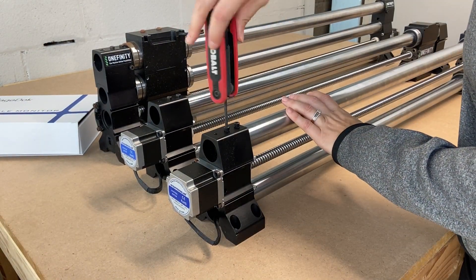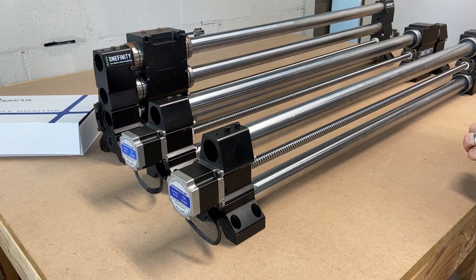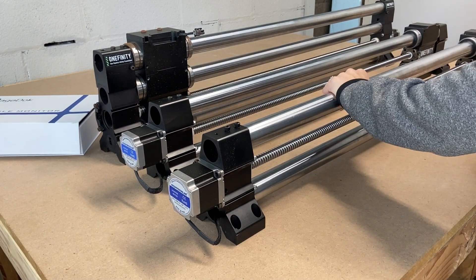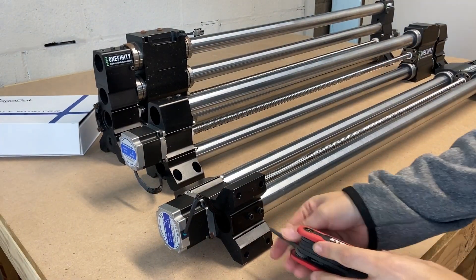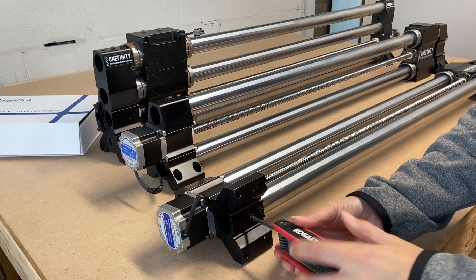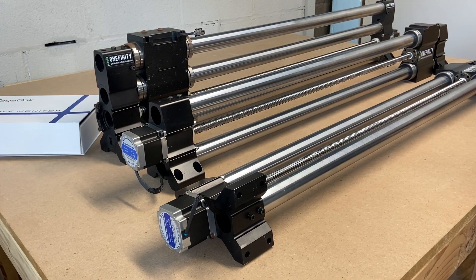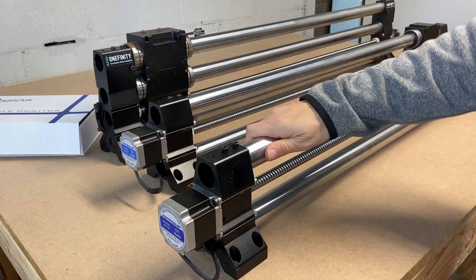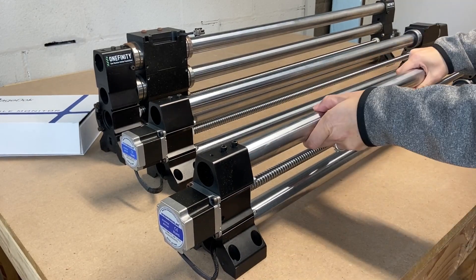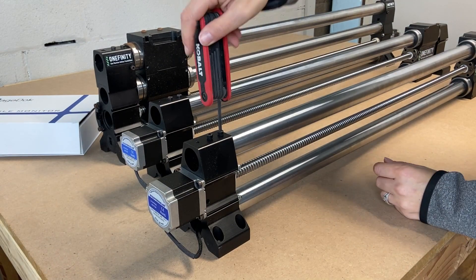So a little bit of housekeeping right away. When I pulled my rails out of the box, I noticed they had a little bit of a rock to them. Luckily, there's a very simple solution. All you have to do is loosen the bolts on the top of both sides of one rail, and then again on the bottom. Once you stand it back up, gravity allows the rails to settle into their original position. They may have shifted because of the things that happen when you ship something.